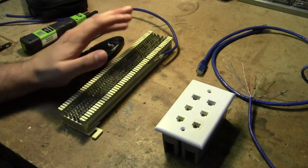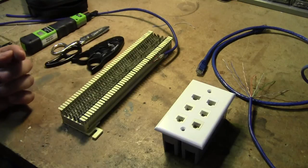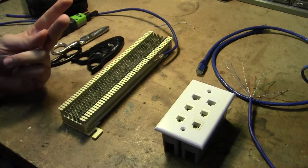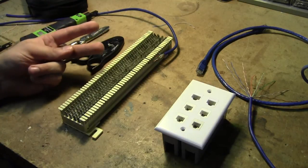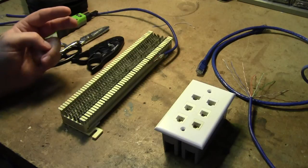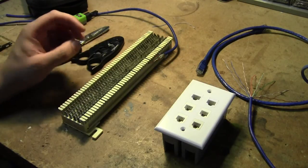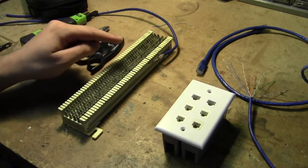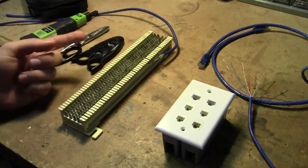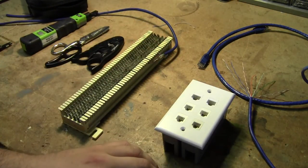My thought on how to do it cleaner is that since these events involve mostly computer Ethernet cables and a lot of RF coax cables, and telephone lines are the only thing that differ, I thought it would be really nice to get rid of all my long telephone cords by converting them onto standard Ethernet cables, and then using those as my long trunk lines between the punch-down block and our actual dispatch consoles.